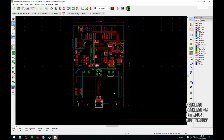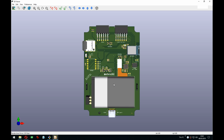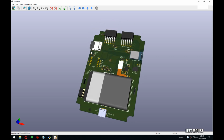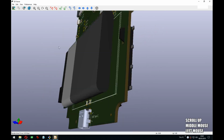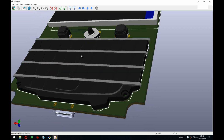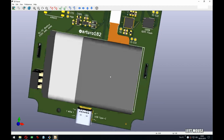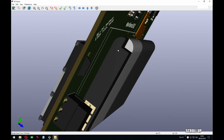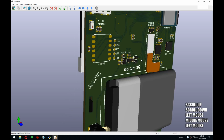Okay, so the reason why it's important is because the keyboard has these snaps on the side, and if it's 1.6, they will not snap. It will just be too thick. See, so here's the board, and here we have these snaps, which I didn't quite model properly, but this is like one of my early Fusion models. It's still quite alright. So yeah, the snaps will not snap if it's 1.6. So that's why it's really important. And I learned this the hard way.